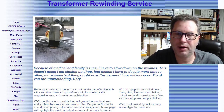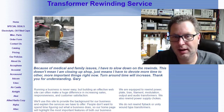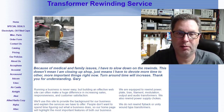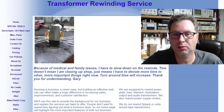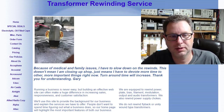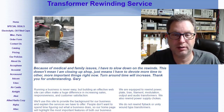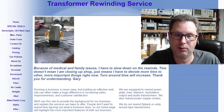Guy does top-notch work, and I had an old transformer one time that had a 110-volt primary, and when he was rewinding it, he asked me, do you want the primary to now be 120 volts so you don't have to worry about it running hot and whatnot? And I said, sure. So it keeps the original factory look in place. It is the original factory transformer.